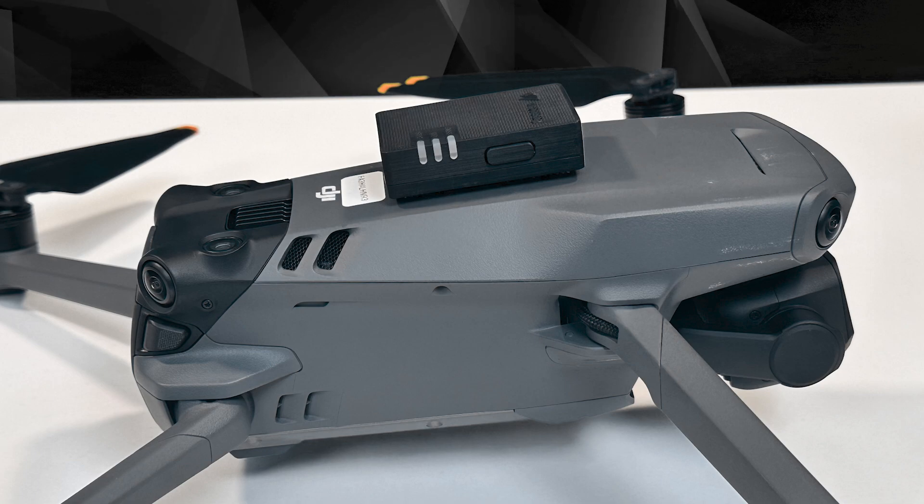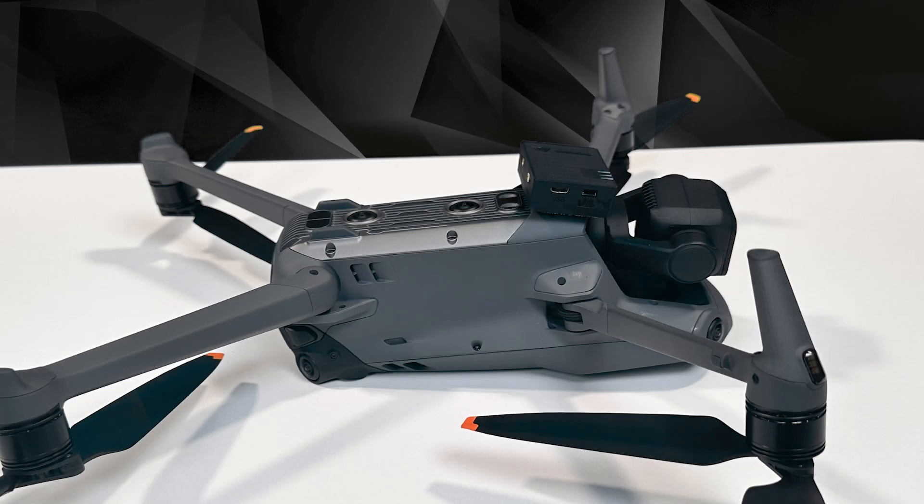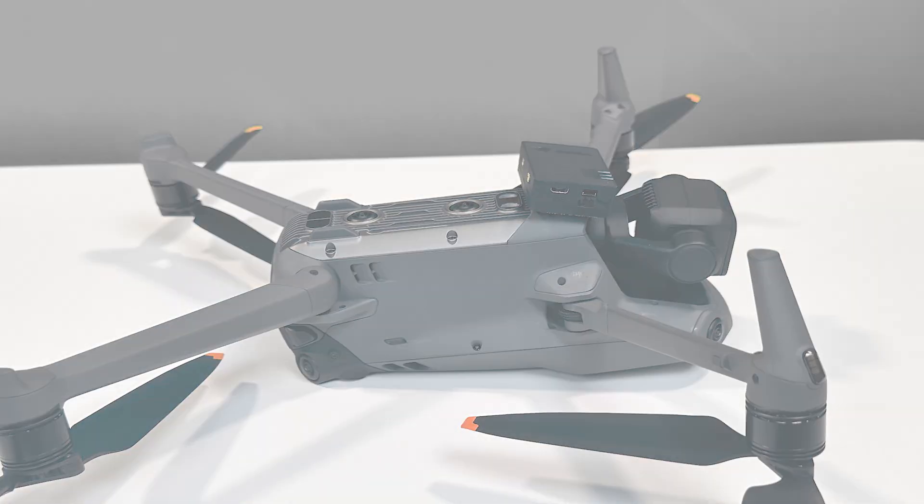Let's talk about placement. If you put your Mini on top of your drone, you can expect a better GNSS signal. When underneath, you'll get a better range for broadcast remote ID. Therefore, the proper location might also depend on your use case.